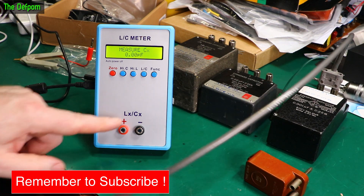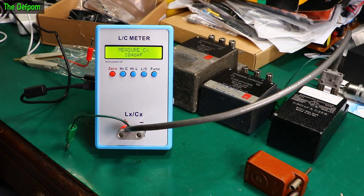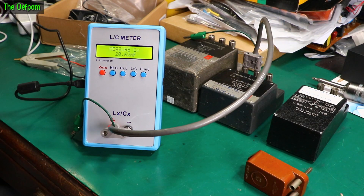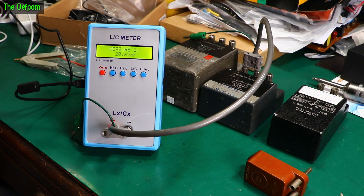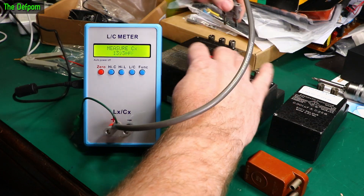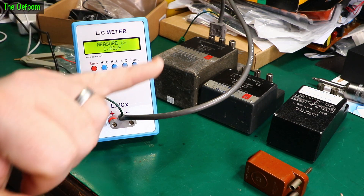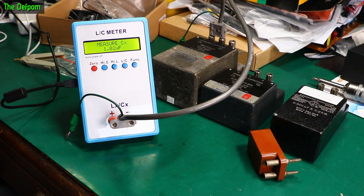Let's try a one nanofarad - and obviously these are standard spacings, 19mm or three-quarters of an inch. One nanofarad - yeah, slightly high but okay. Not perfect, could be better, but it's not bad. 20 nanofarad - okay, it's up there by a fair bit there, 620 picofarad out, but it still says 20 nanofarad. Let's try one microfarad - and 1.02. So it is reading slightly high on everything, apart from this 200 picofarad it looks like. But it is not bad, actually - it's fairly close.